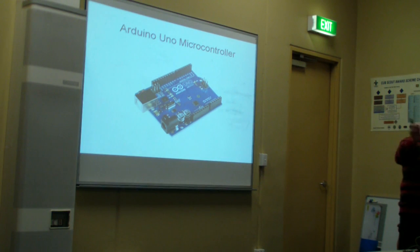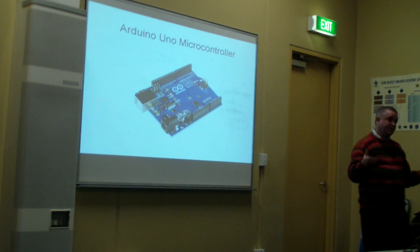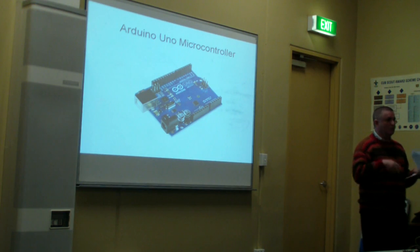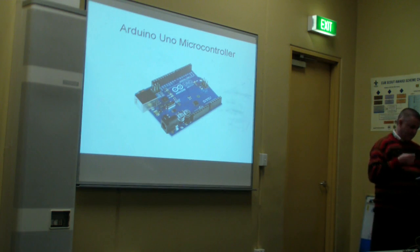Once you wire it up, it'll hunt around for satellites. One there, one there, one there, one there. It takes about 30 seconds from a cold boot, and then through those wires that it's connected to, it will start to spit out at 9600 baud all the GPS information: your latitude, your longitude, height above sea level, the accurate time, which is actually a really useful feature, and also the number of satellites that it's seen. All that information is sent again and again and updated in real time. Move your GPS, and the latitude and longitude will change. It's exactly the way the GPS works in your car or in your mobile phone. So, it's very easy to wire up. Four wires: plus 5 or plus 3.3 volts, I think it was 3.3 volts, ground, and then transmit and receive.